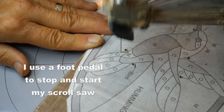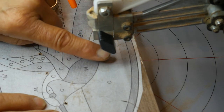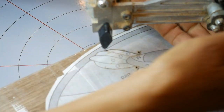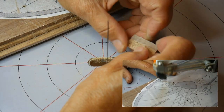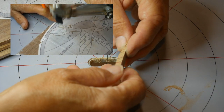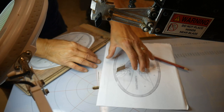You are cutting one inch of hardwood here, four different types, so it's not going to be a fast project. I've cut the outside of the tail feathers; now I've come back to my original pilot hole because it's easier at this angle to cut each one of the feathers. The first tail feather has been cut loose — one just fell underneath, so I'll have to get that. At this point, make sure you have markings showing which side is the front, and which is the top and bottom, because you can see how tiny these pieces are and how confusing they're going to be. Take one of your blank pattern pieces and place each piece that you cut on that, so it's easier later on knowing where they're supposed to go.